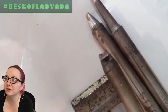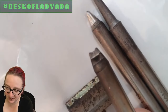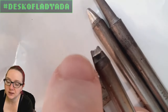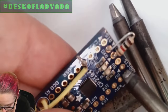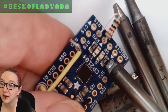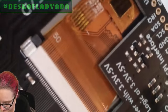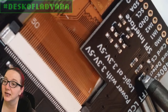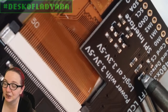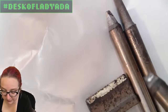This is a resistor remover tip. It looks like something is broken, but it's actually on purpose. This is, I think, a 0603 remover. The tip is exactly the same distance as an 0603 resistor — actually, this is an 0805, let me find something with 0603. It's the same distance as an 0603, so you can heat up both sides at once and then flick it off. Good for rework and removal, not for placement.